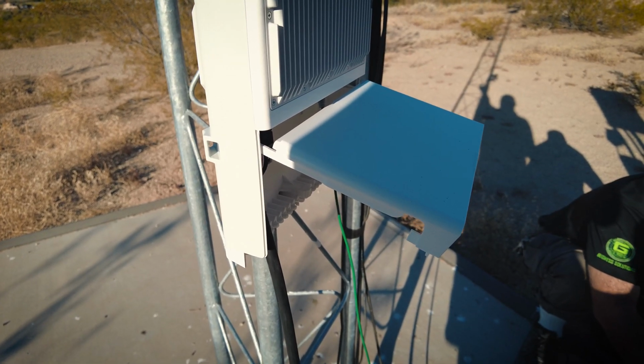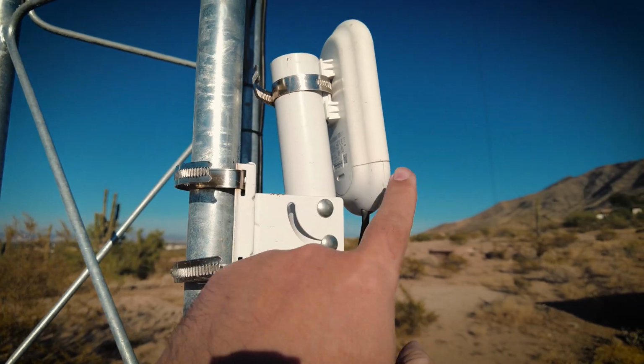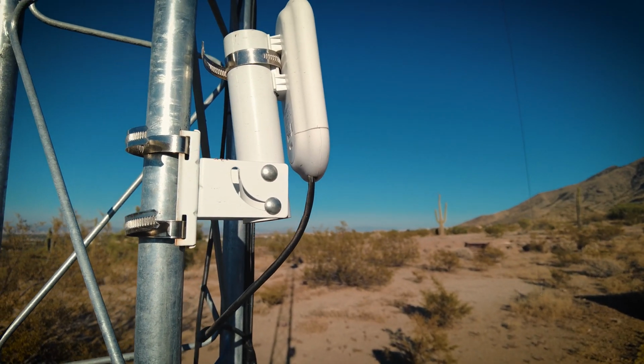So the issue that I'm still left with is the fact that all the radios on the network are static IPs with the gateway in there. So if we change the IP scheme, no worky. I can't think of another way to do it other than just get in there and manually change them all. So I'll have to do that, I guess, at some point when I get home or while we're here. I don't know. It shouldn't be too bad. The issue is going to be the handful of radios that I don't know the login credentials for. There's like 3 of them on the network right now that I can't get into. This being one of them, actually. Right here. This little bastard. Oh, my back. I don't remember the login credentials for it, so I'm going to reset it before I leave. So that's a bit of an issue.